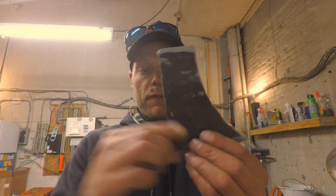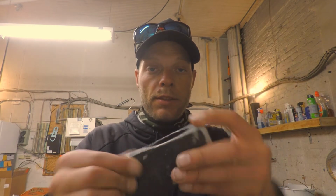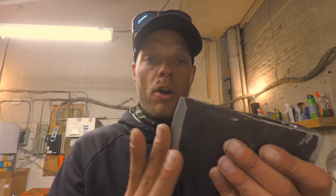It's super soft. I don't know what it's made out of, but I want it to remain soft from here toward the end. I want it to retain some of its malleableness, if that's a word, the softness. But what I want to do is get a little bit of hardness into this edge here, because I want to get a blade edge on it. Not crazy hard, because you don't want it to chip, because you are going to be using this as a high impact tool.